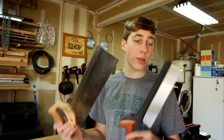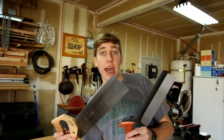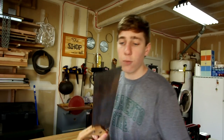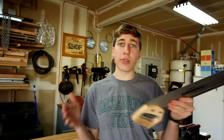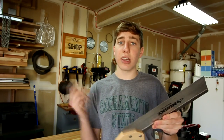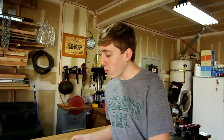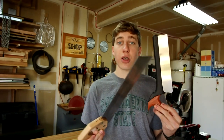Now what I'm going to do is run a couple of tests so you can see for yourself how both of these saws act. I would get the Husky in a rip pattern if I could, but I don't believe these saws come in a rip pattern, because for any homeowner cutting boards, baseboards, trim work, or even studs in a wall, they're normally doing cross cutting. So that's why they don't sell it in a rip pattern — keep that in mind while we're doing the cuts.